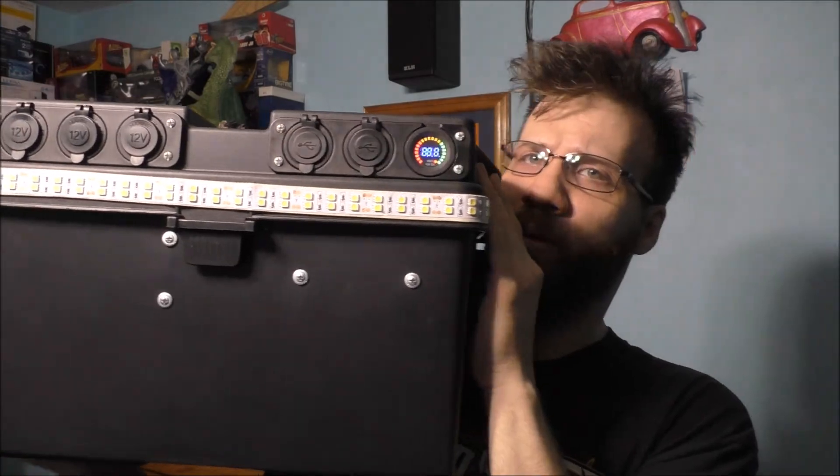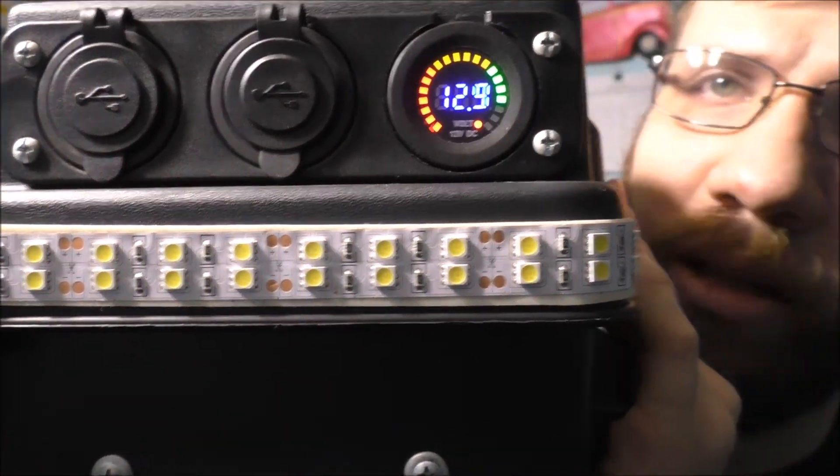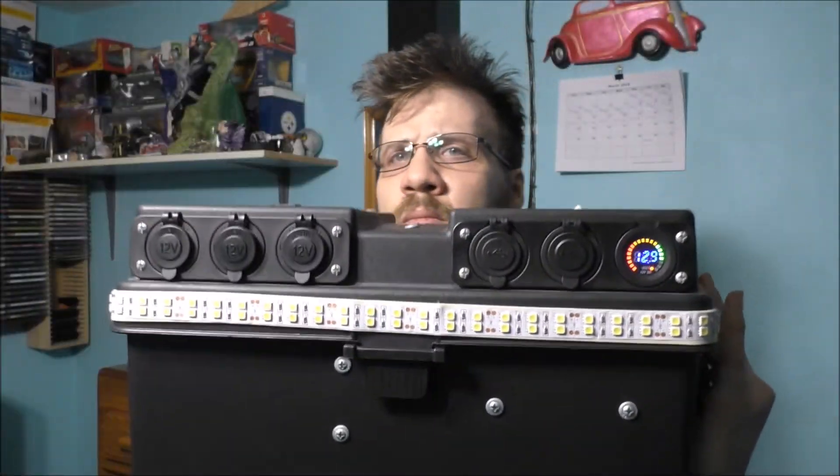That's what I put in this battery backup system, and that's the main heart of the whole entire system — a 12-volt battery. You can use whatever battery you choose, but don't use wet or liquid batteries because they're not very good for stuff like this. This whole unit is not light — it's very heavy. When we flip the switch on, you can see it's all 12 volts, and that's the reason why I built this unit. I wish it was a little lighter some days.